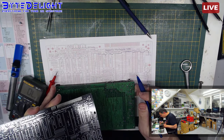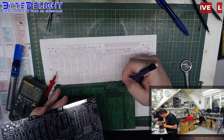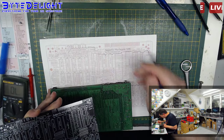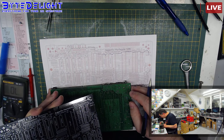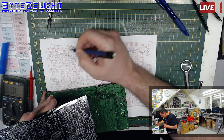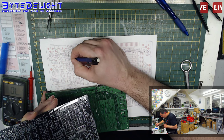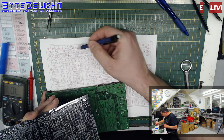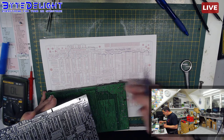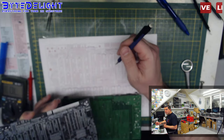And can I see if it's going, this is the end point again, so I guess it will go down, it actually is going down to this pin here, right, and it's also going up to the capacitor, right, and from here it goes down to this pin, and to this pin, so here's the feed of the actual net for these chips, but there's nothing going down here. That's a bit surprising. I would have thought maybe in the middle or on the right side it will go down, but it doesn't seem to be so.